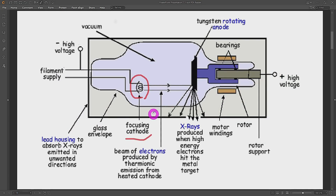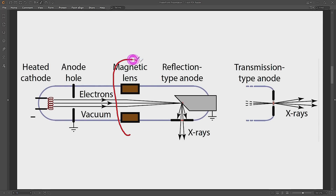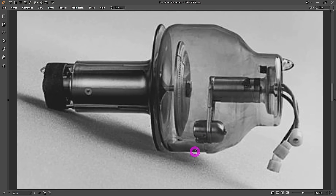These techniques are mechanical — you switch between filaments or rotate the anode. But that's not the only way: focusing cathodes with electrostatically charged plates can push electrons in the desired direction using electric fields, or you can use a magnetic field via a coil, similar to how cathode ray tubes in old televisions moved electrons. Moving electrons and focusing them aren't necessarily the same thing, so something must be happening in the focusing circuitry of our tube — some voltage or current that suddenly comes online and enables focusing.